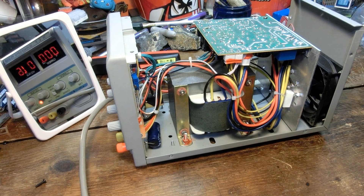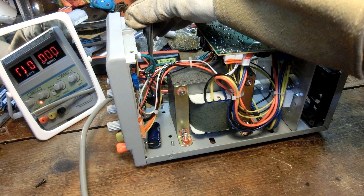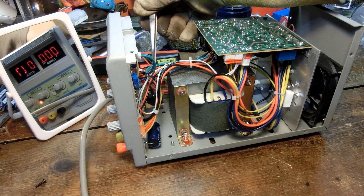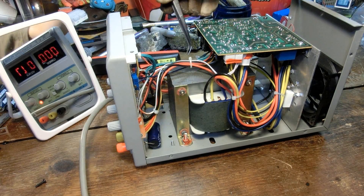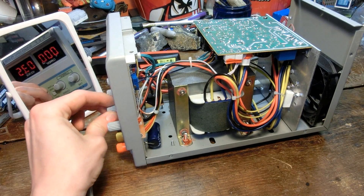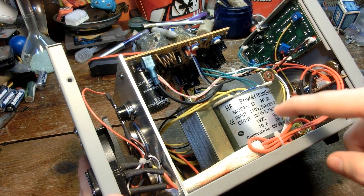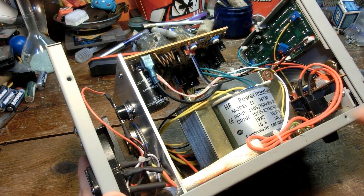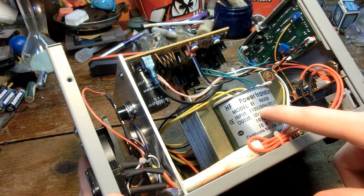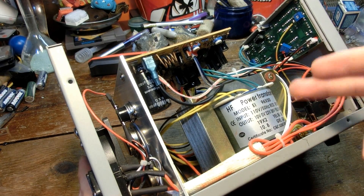I'm just going to see if there are any loose wires back here. I hope it's just a wire, because then that would be easy to fix. It's cool to know I could take this transformer out and use it to give 10 volts, 22 volts, and 38 volts. It's odd that it works on 110V 50Hz instead of 110V 60Hz, because we have 60Hz AC here, and I've heard you shouldn't mix 50Hz and 60Hz transformers because they're made differently.